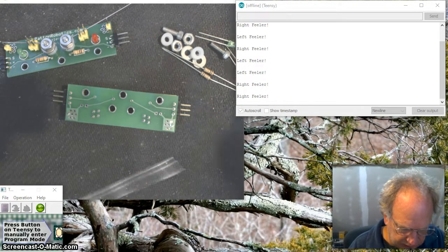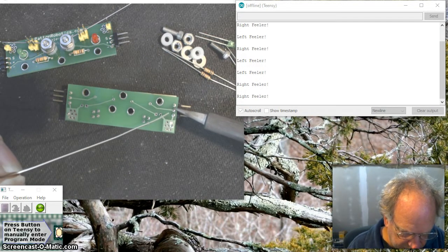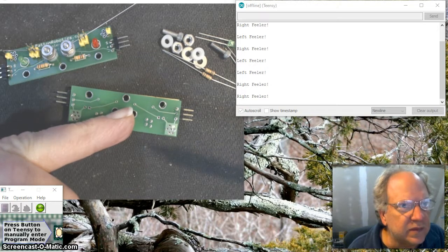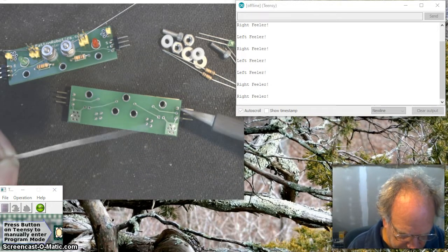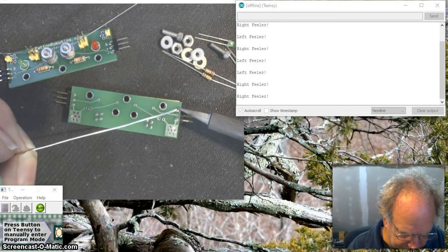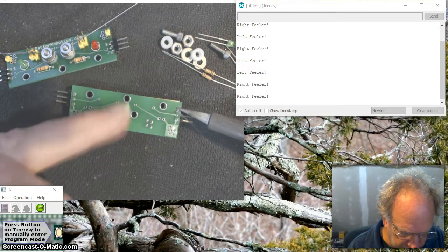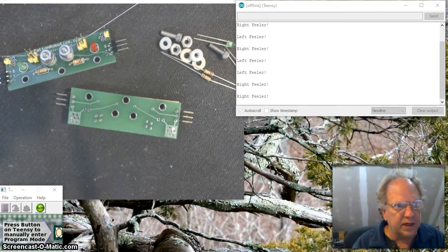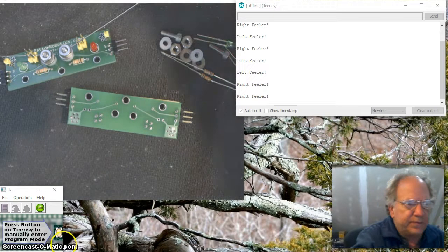All right, let me continue going on. Contact both the base metal and pin. Bring the solder in low, right at the intersection, like so. Okay, and I get a nice solder joint like so. All right, I'm going to continue on. I'm going to pause this. There's no reason for you to watch all of these, and I'll be right back.